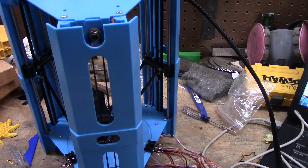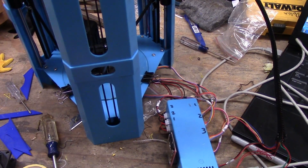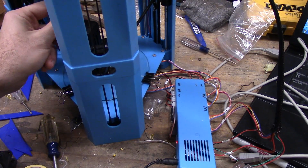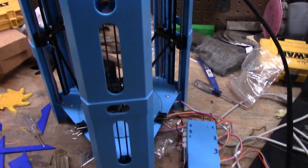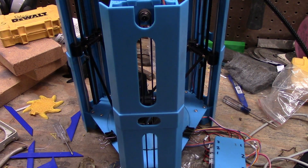The easiest way I found to do this is start a print. So I'm going to start that once I find the power cord — I'm going to try to let you see what I'm seeing. So it is starting its print; it's going to go up. G28 is the homing G-code. If you type that in — capital G, 28, enter — into your host, Octoprint, or whatever you're using, whether you have the developer version with USB, it'll home.